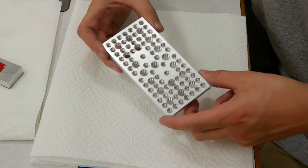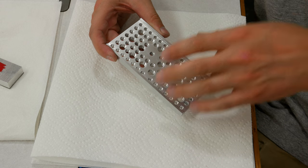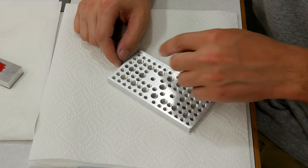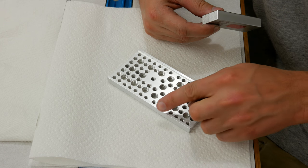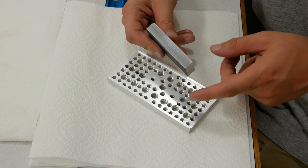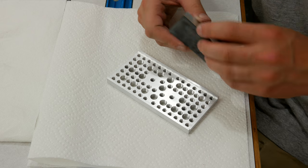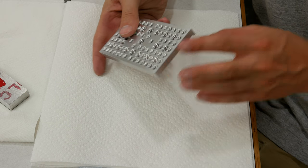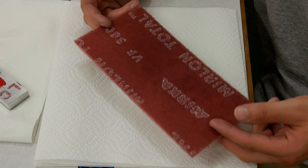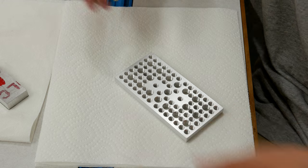This is the finished cheese plate. I can't use a countersink because the holes are too close to the sides — the countersink would just dig into the side and make a gnarly mess. So to clean that up I used this, which is just a piece of scrap aluminum machined on five sides, with 220-grit wet-dry sandpaper spray-adhesived to the large flat side. I just lapped all the edges, all the sides, and then the top. Then to give it a final finish I came back and hit it with 360-grit Mirka Merlon, which is very similar to Scotch-Brite — it's more geared towards woodworking but works great.